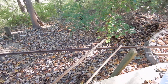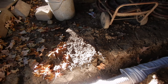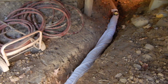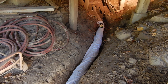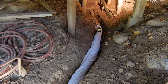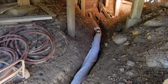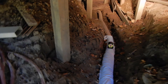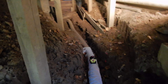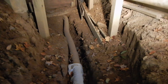For this update, I want to show you what we have done. Mostly, we have dug the trench and we have put the drain pipe — four inches in diameter with the sleeve. Drainage is very likely the most important thing that I can do to my track bed.